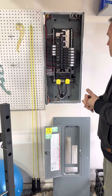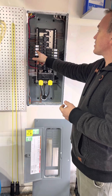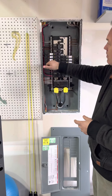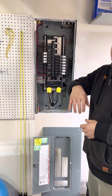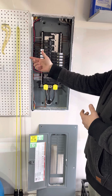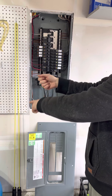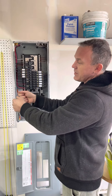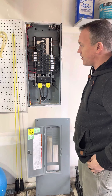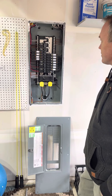The GFCI stands for ground fault circuit interrupter. These purple breakers are actually both AFCI and GFCI combined. The GFCI part is to protect people — if you plug something in that's faulty, it stops the electricity from coming through you and to the circuit. It immediately interrupts it, takes it to ground, and gets rid of the objectionable voltage before it can harm you. It's a safety device for people.